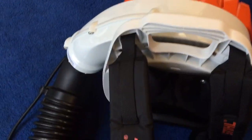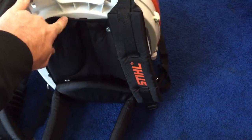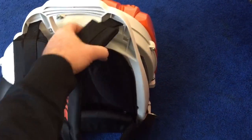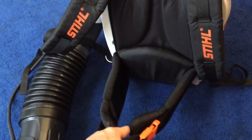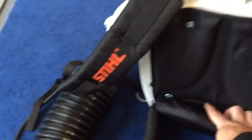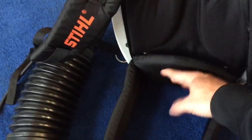The things I don't really like: the straps are kind of chintzy. They're not the nice type with two mounting points like the BR600 has — they just flat-mount and end up pressing hard on your shoulder. The back pad is also lightly padded. What I ended up doing was buying the optional hip belt for the BR500/550 models. As luck would have it, this unit was pre-drilled for it, so I removed the padding from the lower original piece and bolted on the hip pad instead, which now serves as the lower back pad.